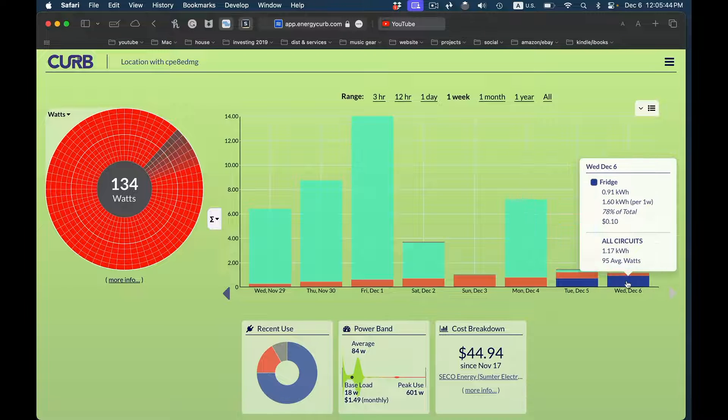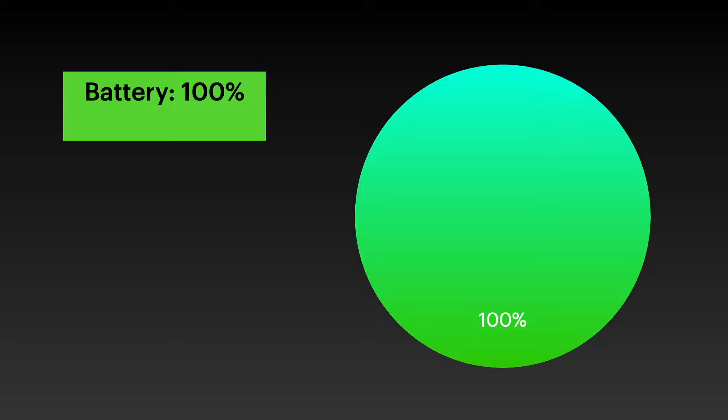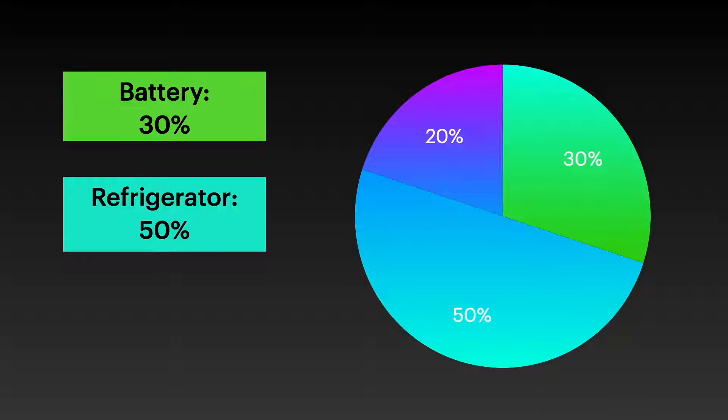Switching from watts to kilowatt hours over a week view: on Tuesday we used about 1.47 kilowatt hours for the refrigerator circuit and 1.17 kilowatt hours for the office circuits — about 2.6 kilowatt hours total over the 24-hour period. Now, the relationship between battery state of charge and kilowatt hours remaining isn't one-to-one, so these numbers aren't perfectly precise. But here's the key point: we started at 100%, used about 50% running the refrigerator and office circuits, yet we're missing another 20%. That's the inverter — inverters pull down 40 to 50 watts of power just by being on, which means you lose about 20% of your battery life in a 24-hour period even if you're not running any circuits at all.